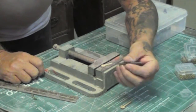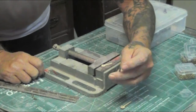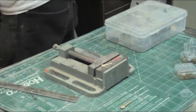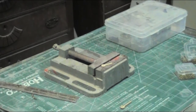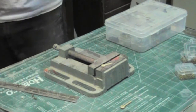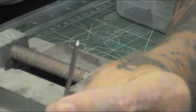Now we have a straight piece of piano wire and we're going to take it over to the belt sander. We're going to taper the end into a peen or a punch. It didn't take long — I've tapered it into a point.